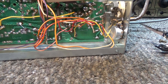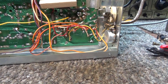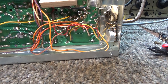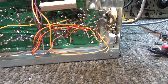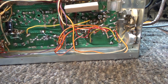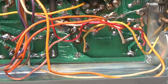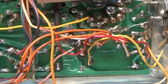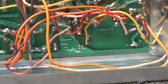I may have done a video on this already, but one of the problems with putting tubes on circuit boards is cold solder joints. What I found on this one is exactly that — it's on this board I'm pointing at. I didn't see it just looking at it.